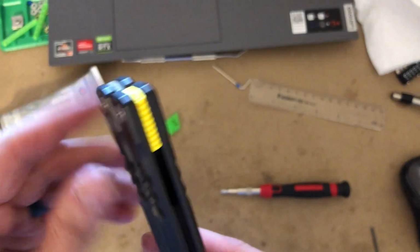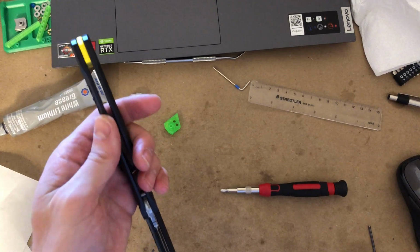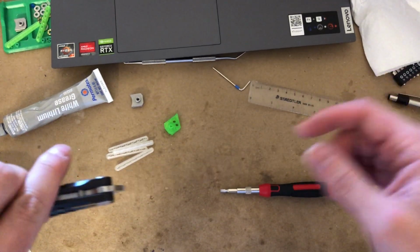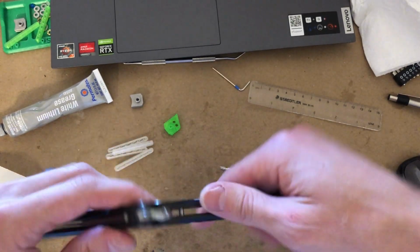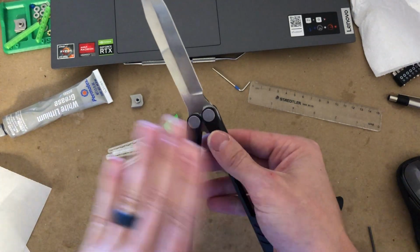For most of y'all, that'll be the end of this installation. I like to be very thorough. If you have calipers, I do recommend using them. Before we do, I'm going to ensure that I have tightened the pivot screw properly. I'll tighten it and then check for play. It's a bearing knife. There should be zero pivot play.